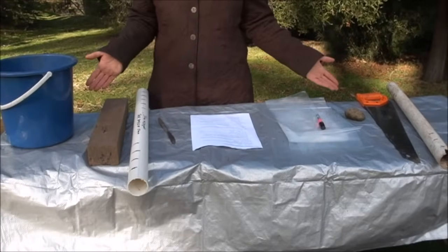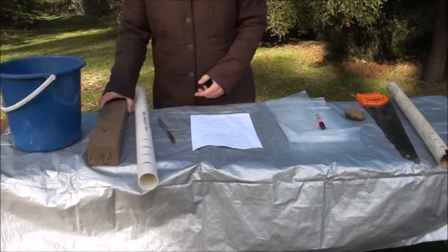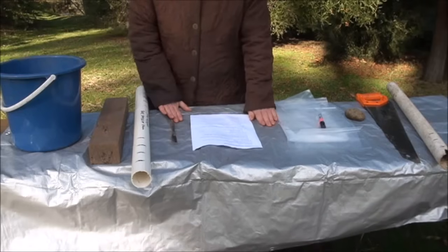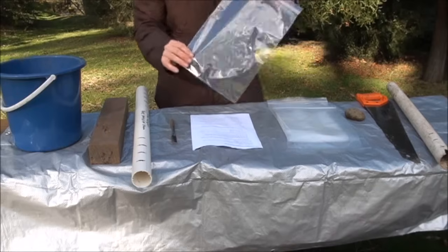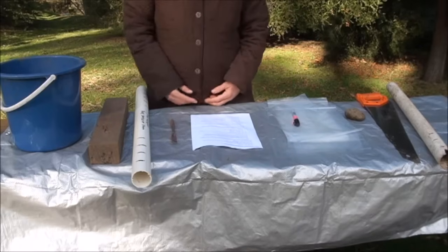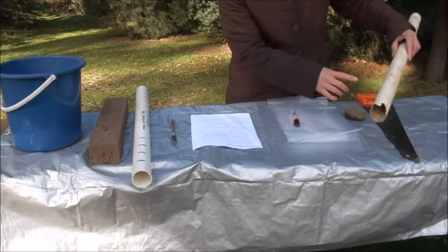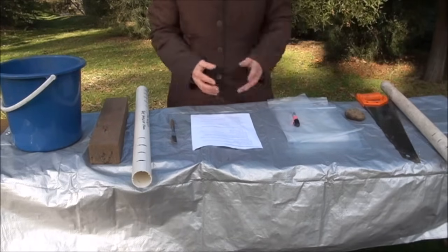Here's what you'll need in your kit: a bucket, a sampling tube, a pine off-cut for beating the sampling tube into the ground, a butter knife to remove your sample, a tarp where the sample will be laid out and reduced, and a plastic bag and marker so we can get that sample safely bagged and labelled. You might also need a saw — in case your sampling tube gets damaged by a rock, you can cut it off at the marker and continue using it for more samples.